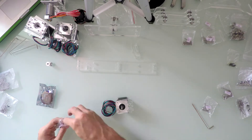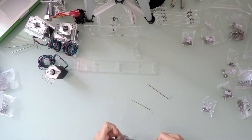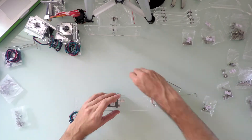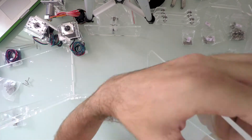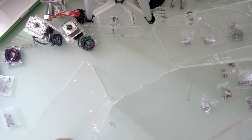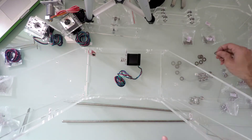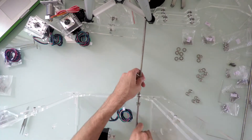After that, I fastened the Y-axis motor to its frame, the belt to the motor, and secured the end stop button in its place. Then it was time to start with the big parts. I assembled both legs of the frame by simply fastening them with the screws. Every piece is well marked and has grooves to slide in the nuts that later will secure the screws. Then I attached the back plate containing the Y-stepper motor and the frame's structural rods.